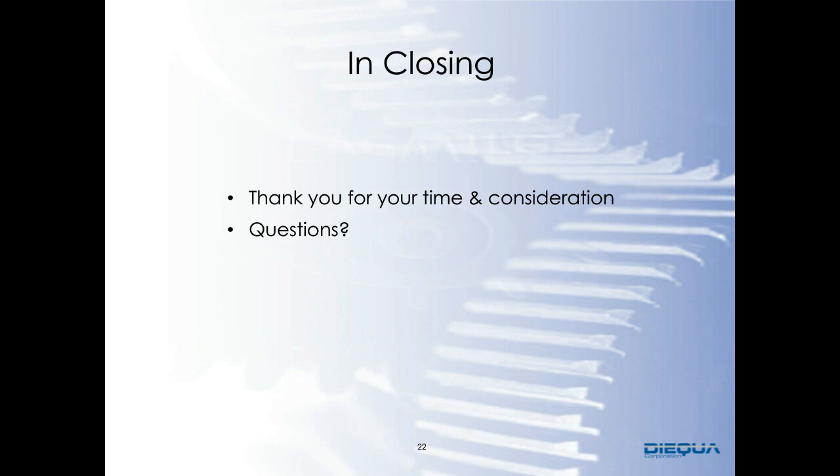Okay, I want to keep moving through here. Tom, the next question we have is, when it is applied for a vertical lifting situation, what is the holding torque identified and impact capacity? When we look at the torque capacity of the gearbox, in particular, we reference 3 different classifications, and it is a function of lead angle of the worm shaft relative to the pitch.